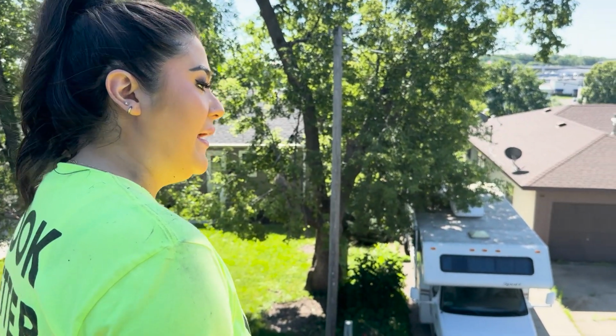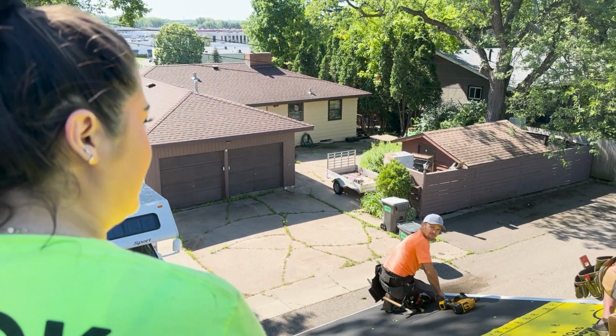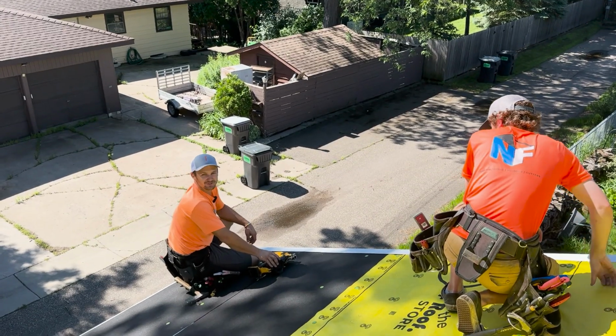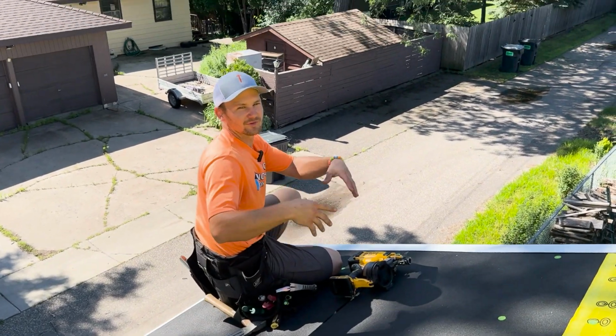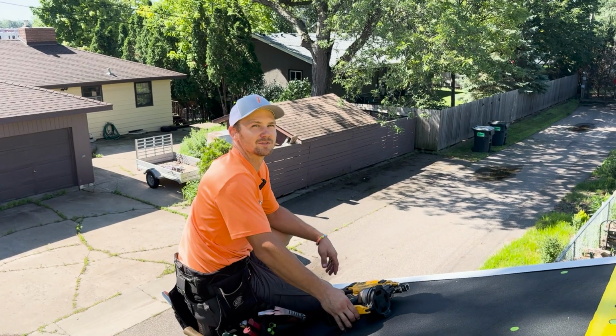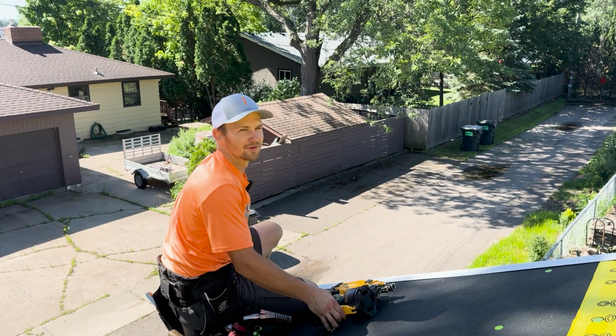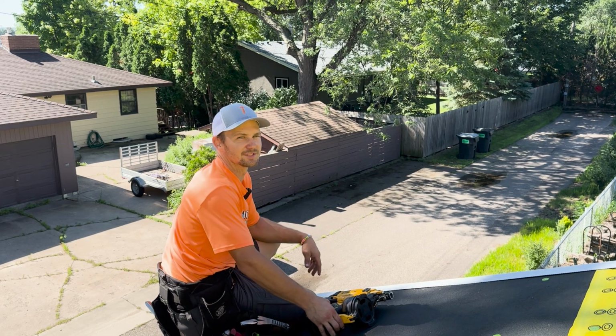When you're doing a repair where another roofer did the original job, when do you generally see mistakes? Yeah, usually around penetrations. If you look at the roof, like the plumbing stacks or the vents, or the big thing is chimneys, because I feel like a lot of companies don't replace the chimney flashings. Now they're getting a little better, but usually it's around when you're reusing stuff like chimney flashings.